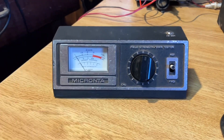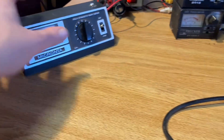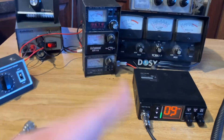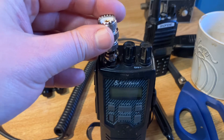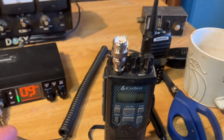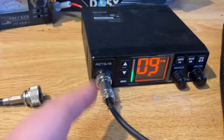Let's say you already have your SWR meter. Along with the meter, you'll need a patch cable for attaching the meter to the radio. But here's something I didn't think about the first time around — you might actually want to get an adapter, because not all radios use SO239 connectors. This BNC to SO239 connector pops right on, so out in the field I can check my antenna without running into the shack.